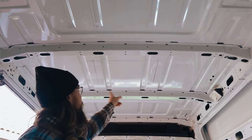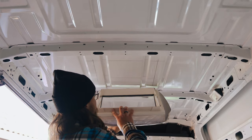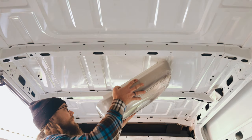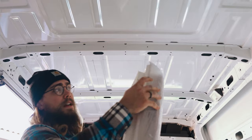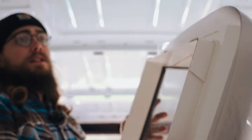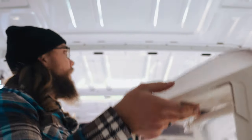I've already marked out where I'm going to put it and I've measured and double checked. I've just gone around with the skylight and checked that once I've cut it, it'll fit in and there's still plenty of overhang on the edge. This is where the sealant will actually sit — you can see that little groove there — that's where your sealant is going to sit and glue it to the roof.